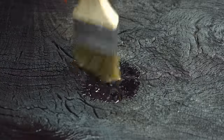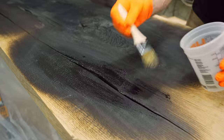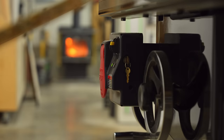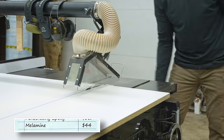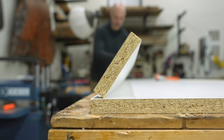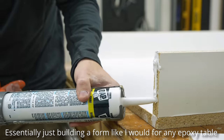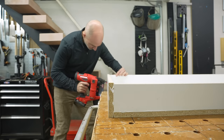After soaking that slab down I let it set for about a week before moving on to the penetrating epoxy — probably the most important part of building one of these burned wood and epoxy tables, because you really need to seal up those burned sections or they will get a ton of bubbles. I spent some time with the penetrating epoxy and just sealed the whole slab. A couple of months ago a contractor recognized me and complimented my work, but the next day looked at my caulking and said I sure wasn't going to make a video on caulking — and he was right.